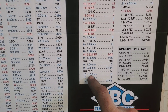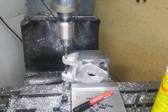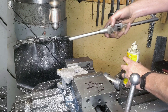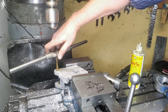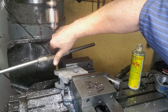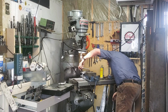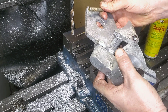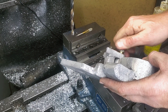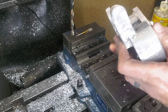Let's walk over to the drill tap chart and see what we're working with. It turns out we're working with a metric and we're going to need to drill a letter size R. Here's the third trick of the day: I'm going to grab the most ridiculously large tap handle that I possibly can find — for a specific reason. I'm only going to hold it on the inside of the tap handle because I don't want all that leverage. What I'm going to use it for is gauging whether the tap is going in vertical. Because the tap handle is so long, I can tell whether it's parallel with the work from both axes — front and side. Just be careful if you replicate this technique: don't grab it from either end because if it catches, you may very well break that tap off in your work, and that's going to either be a lot of work or starting all over again.